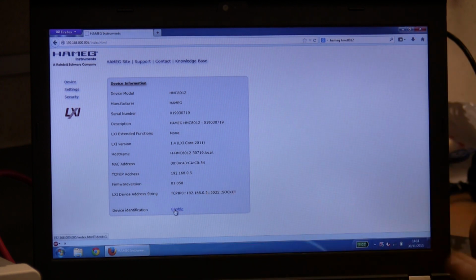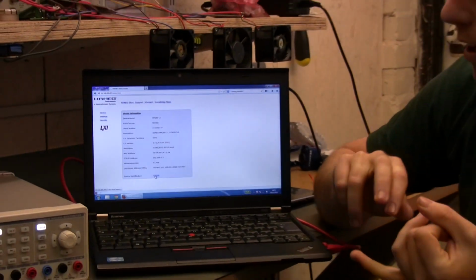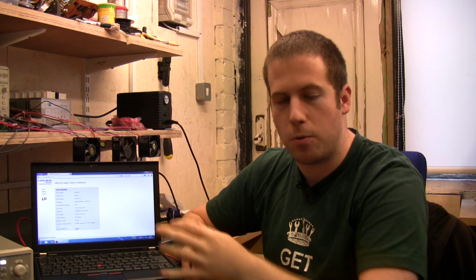device. So on here, not particularly exciting, but I should mention that obviously this device does support LXI, which is LAN extensions for instrumentation. So you can actually send test and measurement commands directly over LAN, not through web interfaces or anything like that. The USB, we showed you the USB through the virtual COM port, which allows you to send commands, that sort of thing. You can also bypass that and send commands directly over USB, which is slightly faster and sometimes easier. So that pretty much covers the interfaces.